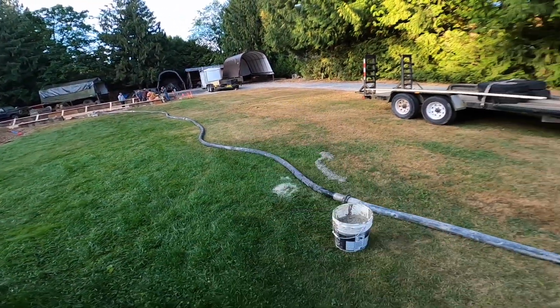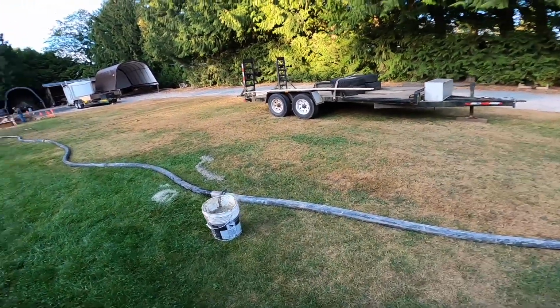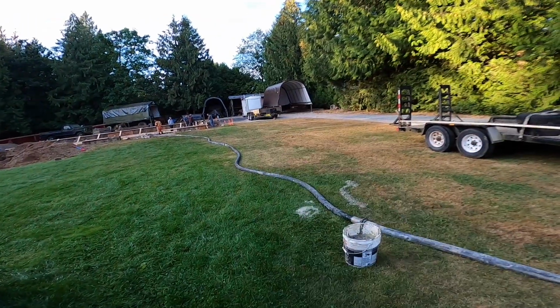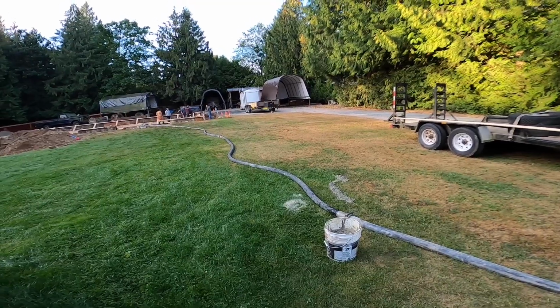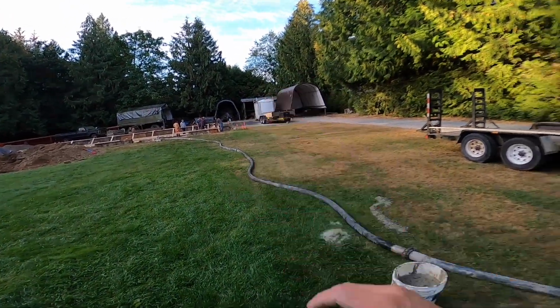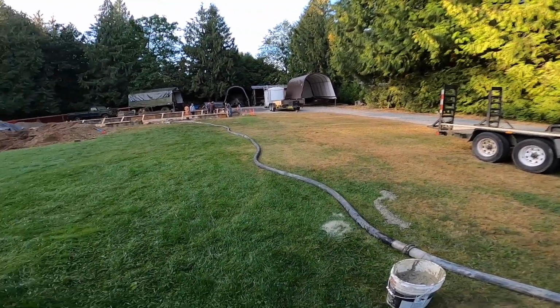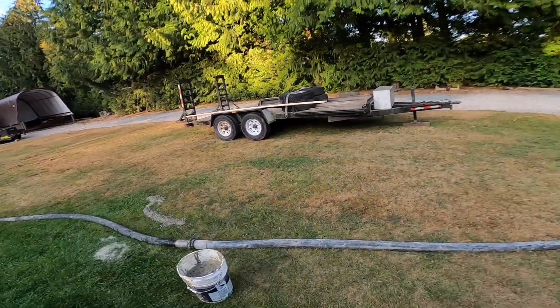You get 2 hoses from the end, you're going to cut that down to about 25. Our ultimate target here is to exit that sponge out of the last hose at between 5 and 10 psi of air. It takes time and it takes a little bit of finesse. Once again, do not be in a hurry. Once you get 2 hoses from the end, you're probably going to cut things down to about 15 to 20 pounds. Once you get close to that last hose, you're going to be at 5 to 10.